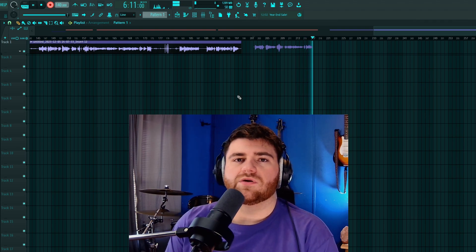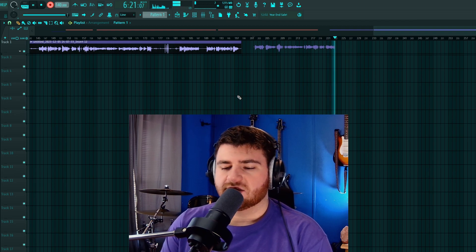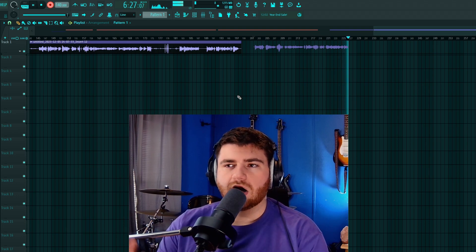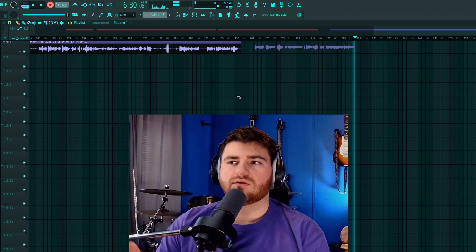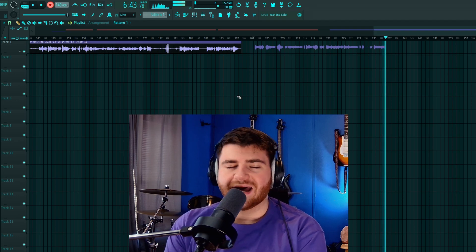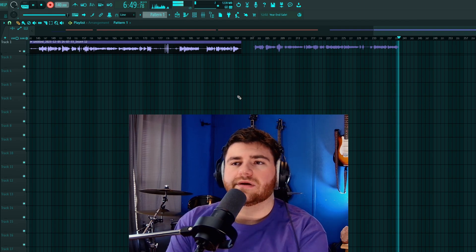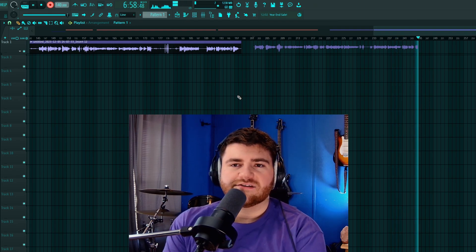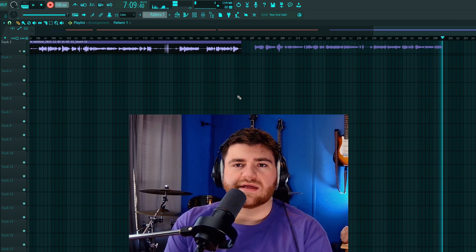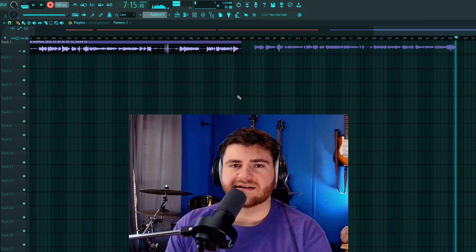Final thoughts: it's not bad, it's definitely different. I used to record a podcast with a friend, and using a microphone like this for a podcast — which is what it's marketed for — would definitely help with off-axis rejection; you don't want the other person's voice coming into your microphone. For streaming and content creation it's not bad either. The focused pickup is handy, though the proximity requirement and gain-distance tradeoff is just the nature of any dynamic microphone.